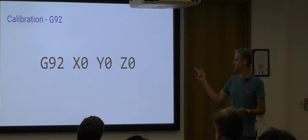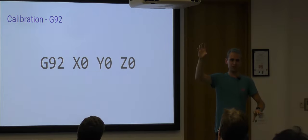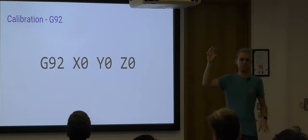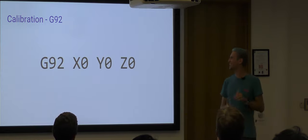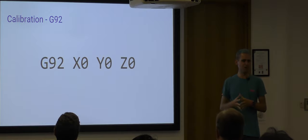And in the case of trying to use this command, moving the carriages away from each other longer than the rods and the effectors, it rips itself apart, which is fine if it's one of those magnetic ones, because you can just bring it back together and clip everything in again. If you're using rod ends, you usually snap filament and stuff like that. So that command isn't safe to use on Marlin, on Deltas. I don't know about other firmwares.